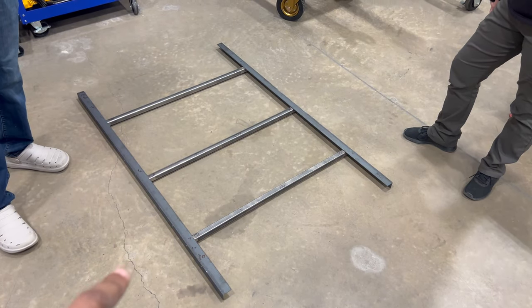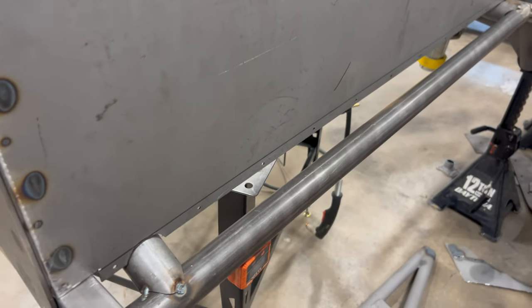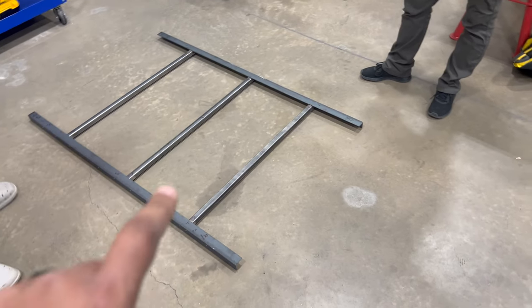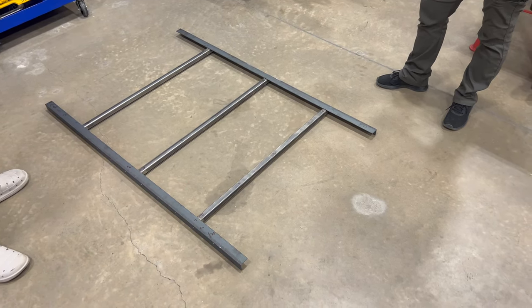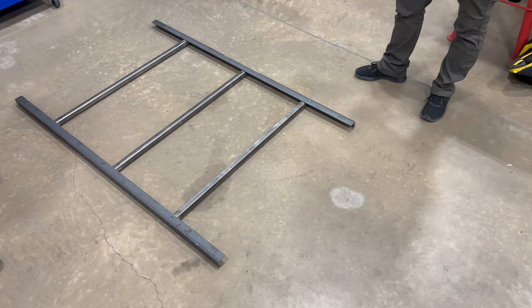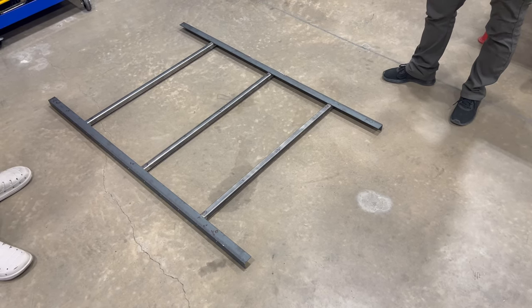We're gonna cut this thing apart. We've got two things to do. The holes are already drilled in it for the inner fender wells. And this is the height that it's gonna sit at here, which is why it's marked. And we've gotta take about an eighth of an inch. So we decided it was better to err on being too wide than being too narrow. So we definitely erred on being too wide. So time to fix that problem.